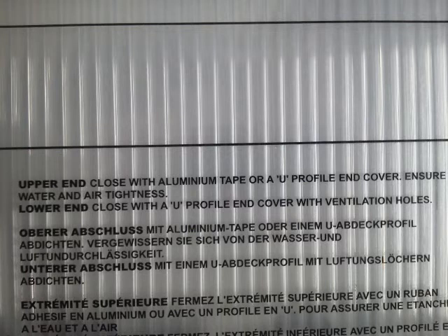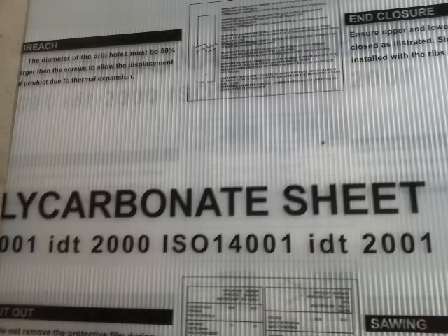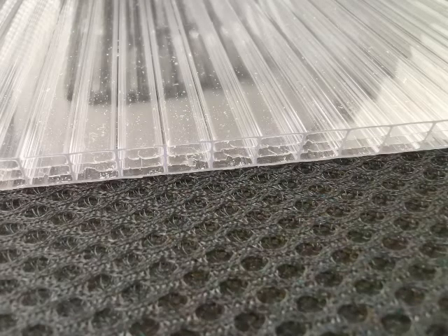In testing, I want to compare a regular twin-wall six millimeter to the quad-wall six millimeter. I also want to split the quad-wall three-air-gap sheet into a four millimeter triple-wall with two air gaps and a twin-wall two millimeter with one air gap, and run thermal tests on them. I may also do some stress and strength testing. After testing, I'm considering using them as undercooling for the solar panels on my car, and I'm also looking at a solar thermal collector, a greenhouse, and a heat recovery ventilator.